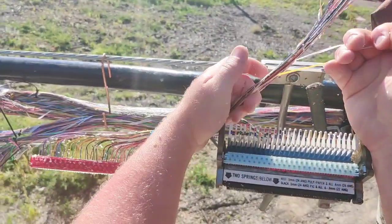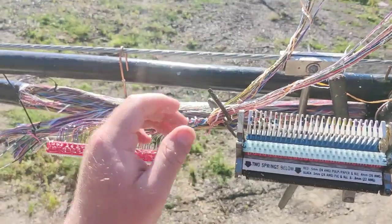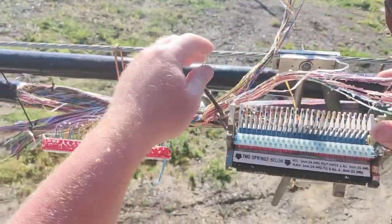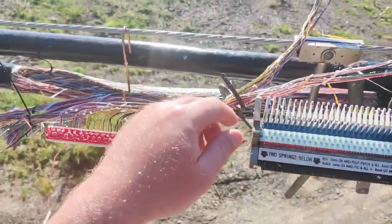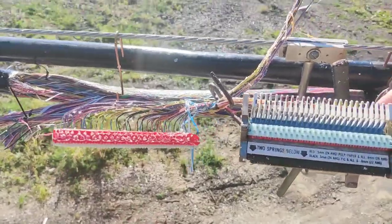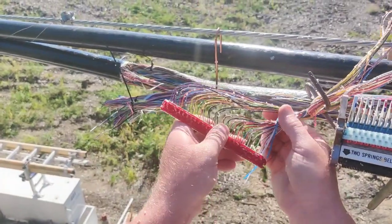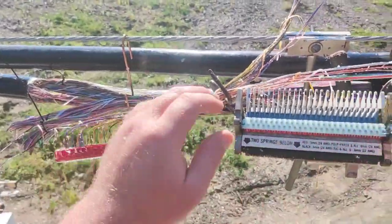A couple videos I've seen on YouTube don't really explain this well and they don't do it right. They come off the cable and go straight into the back of the splice head with the cable all fanned out. The right way — or at least the prettier way — is to use the arm. They come in different lengths; some slide in. You bring it in and around, and your cable comes in at an angle on the side. When you're done with your splice it lays nice inside your terminal and pedestal, rather than coming in sideways. The mods want to fit in lengthways.